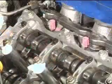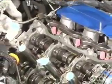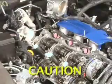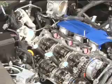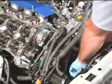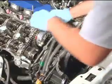With the tensioner removed, use the hexagonal portion of the intake camshaft and carefully rotate it until valve spring pressure releases. Caution: the camshafts may spin quickly. If this step is skipped, the valve train will rapidly rotate due to valve spring pressure, which can cause the chain to bind. Next, rotate the crankshaft until the flat surface of the exhaust gear is facing the intake gear. This will allow space for chain removal. Then lift the chain off the gear and hang it on the VVT actuator.